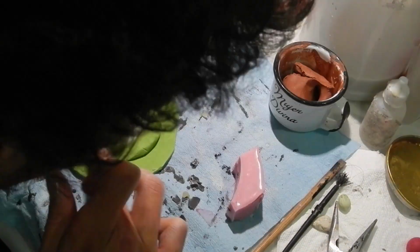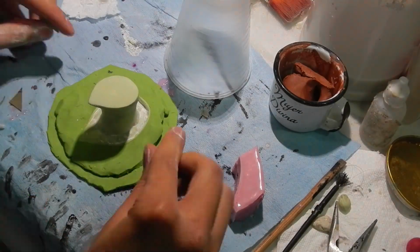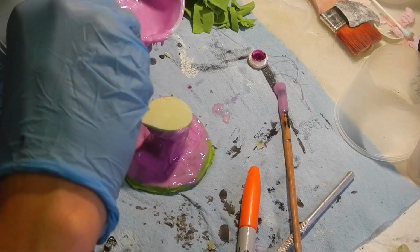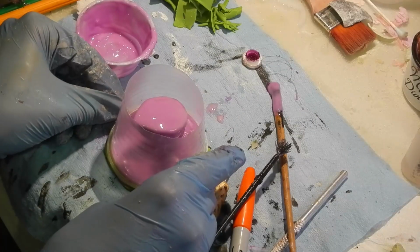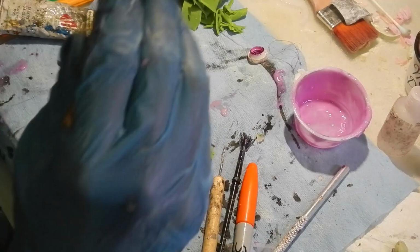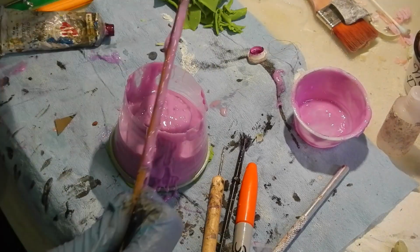We made the mold just like the other silicone molds. First we made a plasticine base and made its keyholes. Then I applied a thin coat of silicone as a beauty layer and then put a cut-in-half plastic cup to use as walls for our mold. I prepared more silicone and cast it from the top.